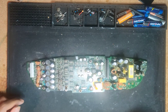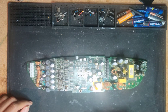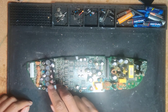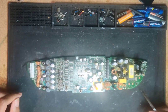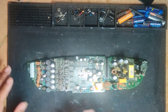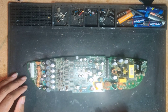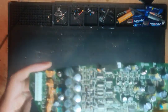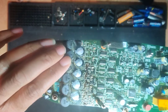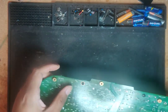Two things that plague this system are the capacitors — some parts are missing, long story on that — but I used this board to fix two other units and had to figure out what the problems were. The caps swell up; I don't know how well the camera picks it up, but the caps swell and start leaking. This one also had a partially failed amplifier.